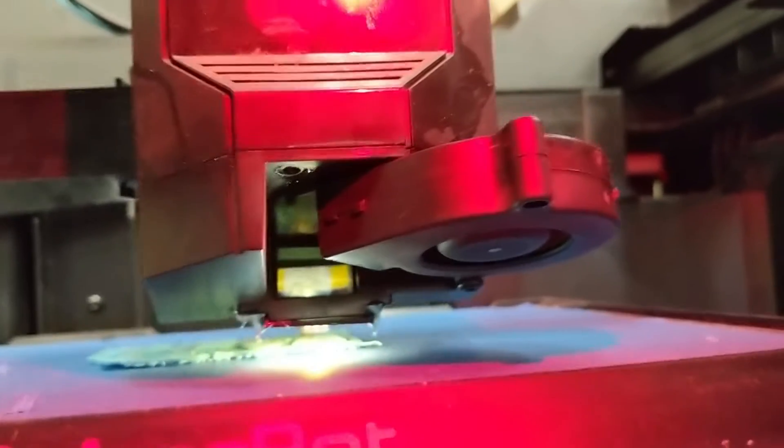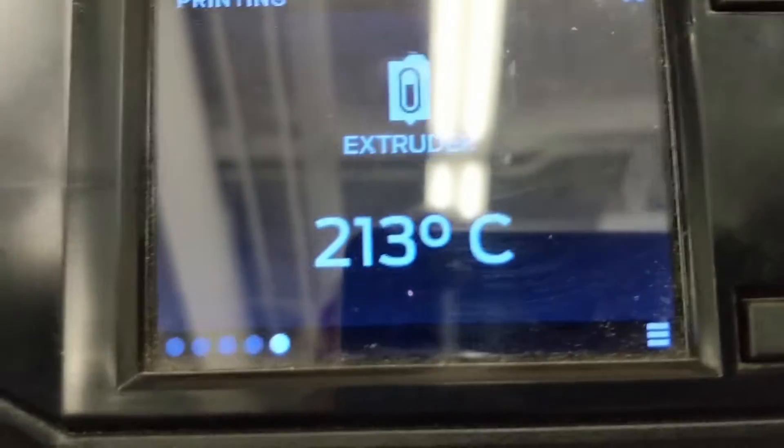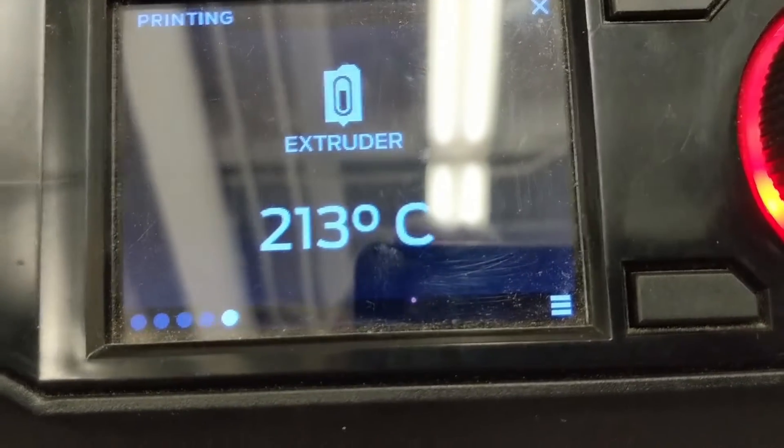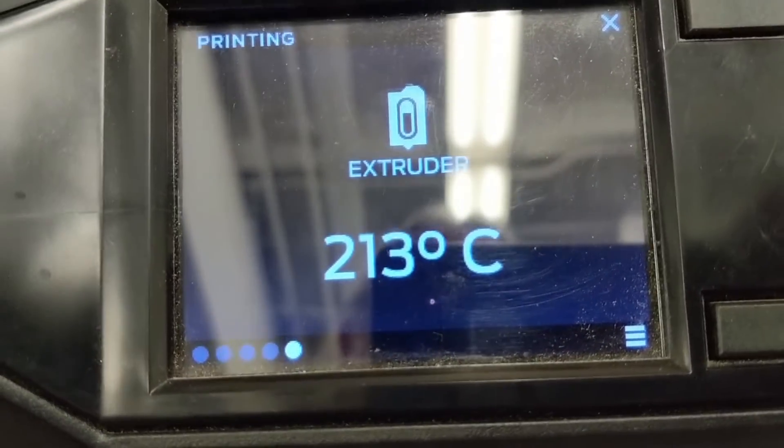Notice one bolt is taken out of the fan and it's pulled away. I kept getting the number 57 error from MakerBot. With the fan pulled away, it's not going below 195 or 190 where it sets the trigger — it's staying up at a higher temperature. I want it near 215.